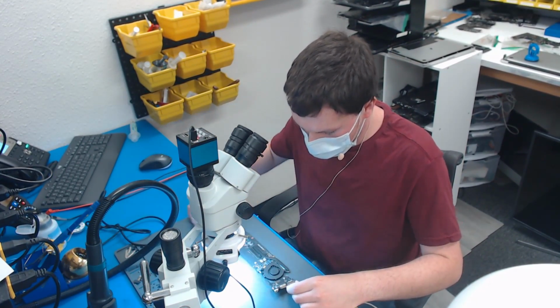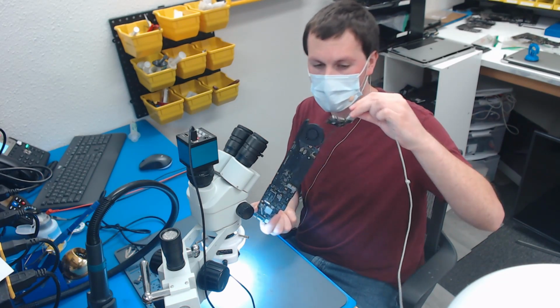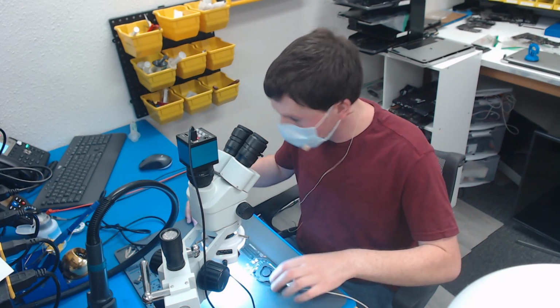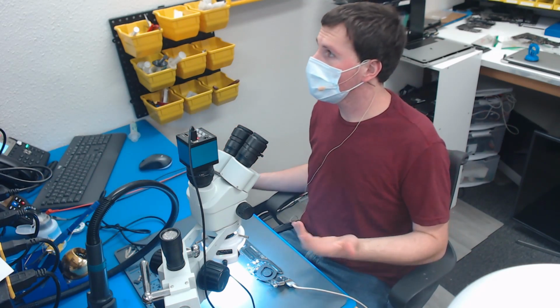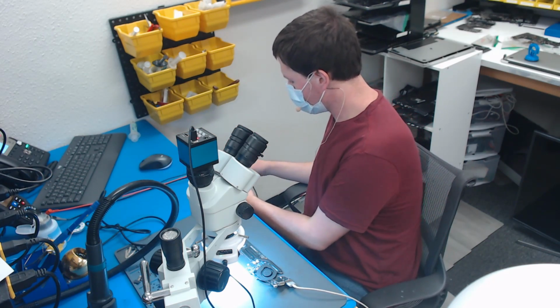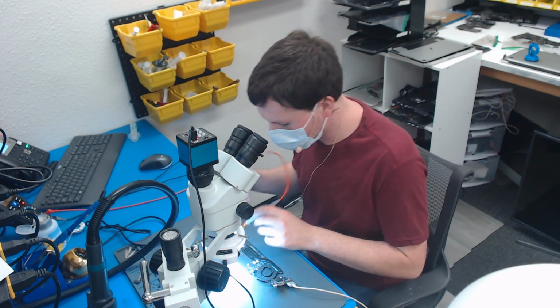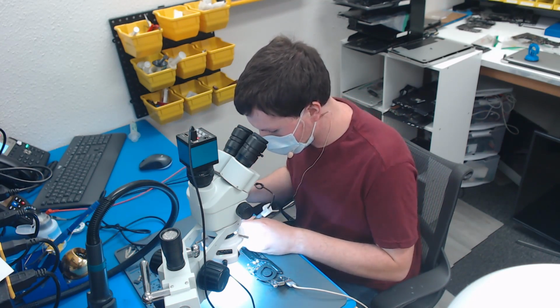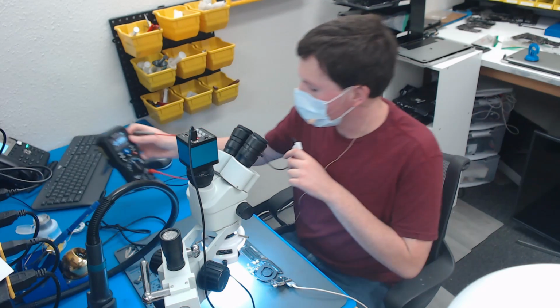So we have our DCM board plugged in. It will not give us a green light in the charger because there's no I/O cable plugged in, and we do need those. So the very first rail I check on this board is PP-Bus G3 hot. We're going to check PP-Bus G3 hot on the system side of the fuse for a couple reasons. So we'll get into that. PP-Bus G3 hot is 0 volts on the system side of the fuse.